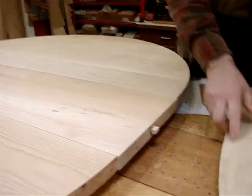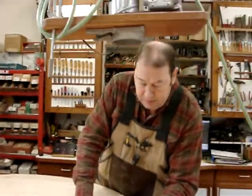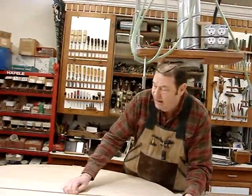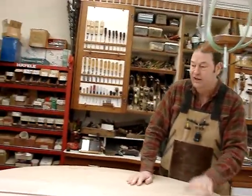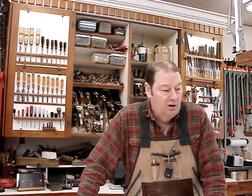And there you have it. Now this leaf can be taken out, I can trim it on the table saw, sand it, and it will fit precisely in this location or any of the locations. So all six leaves become interchangeable. So this is our process for doing it. I know there are a lot of great woodworkers out there, so if you have a process that you like or want to make a comment on it, we'd sure appreciate that. We want to do the best work we can. Thank you for watching today.